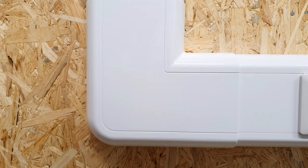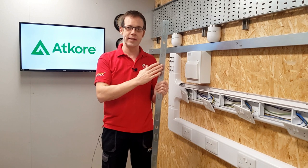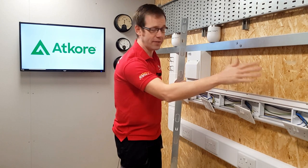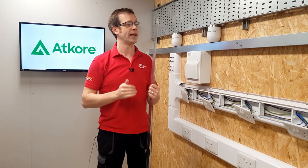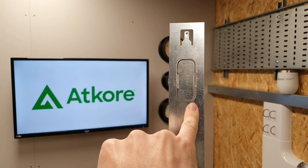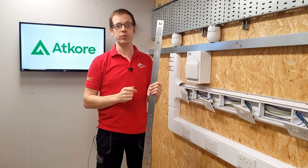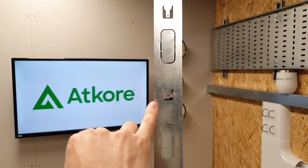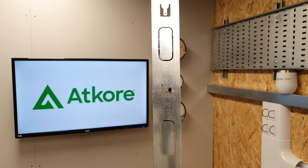For optional extras, first there's a steel screen divider that sits in the trunking between the sections and helps to reduce electromagnetic interference between mains and data cables. It's pre-punched with holes that line up with the knockouts in the trunking and can just be bent out and snapped off, giving easy access for data cables to drop into boxes. It also has connection tabs that can be bent up with the right type of crimp pressed on to make a good earth connection.